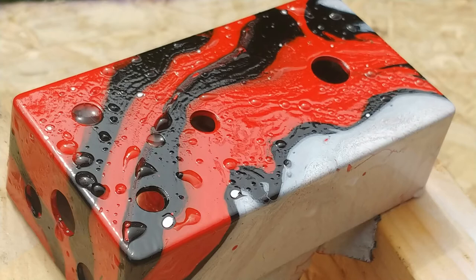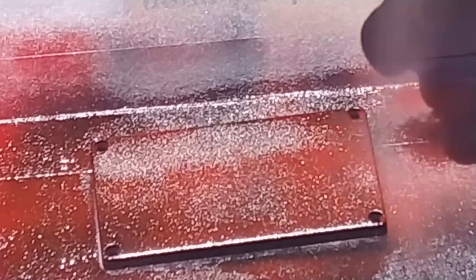You'll also notice that I added a couple of little plastic handles to hold the enclosure while I dip it. There are many ways to achieve this — mine are just duct taped to the inside, real simple. The proper time to add these handles was actually before I sprayed the primer coat. It was pretty hard to move the enclosure and attach the handles without damaging the primer coat, and I actually had to touch up a few spots off camera. Next you can see me spraying the clear coat — first on the back panel that I spray painted earlier, and then on the main enclosure that we just hydro dipped.